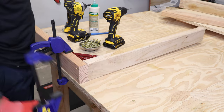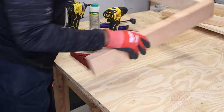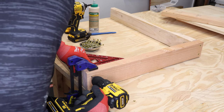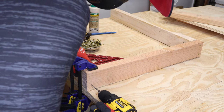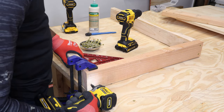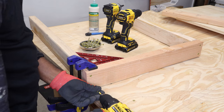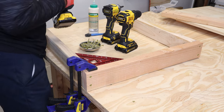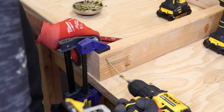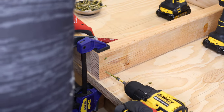We're going to do this for all four sides — take off the clamps, rotate it over, clamp it down, and drill, repeating the process again to drill pilot holes and put in our screws. The key here is to make sure that you drill those pilot holes, otherwise you run the risk of having your lumber split on you, and that's never fun — trust me, it's not something you want to encounter. On our last side, we're going to check for square, then drill our pilot holes and put in our screws for our last corner.